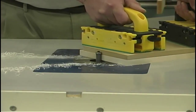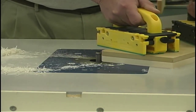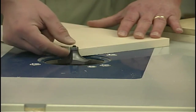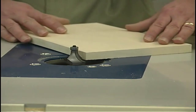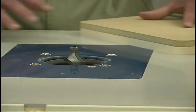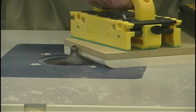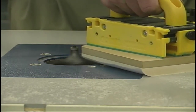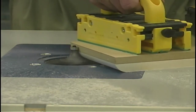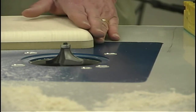To do the cutting I've got a half inch template bit in my router table, and I can very carefully guide the workpiece along taking the cuts. Now we can go ahead and round over the top face of our lid. We're going to be using a three-quarter inch radius, and our lid is only five-eighths thick — so if we did this without our template, our workpiece would slide underneath our guide bearing and that wouldn't work. That's why the template is so important. As we bring our workpiece in and start cutting away the material, eventually the guide bearing will be following along on our template. Using that three-quarter inch bit really gives the profile a nice look and feel.